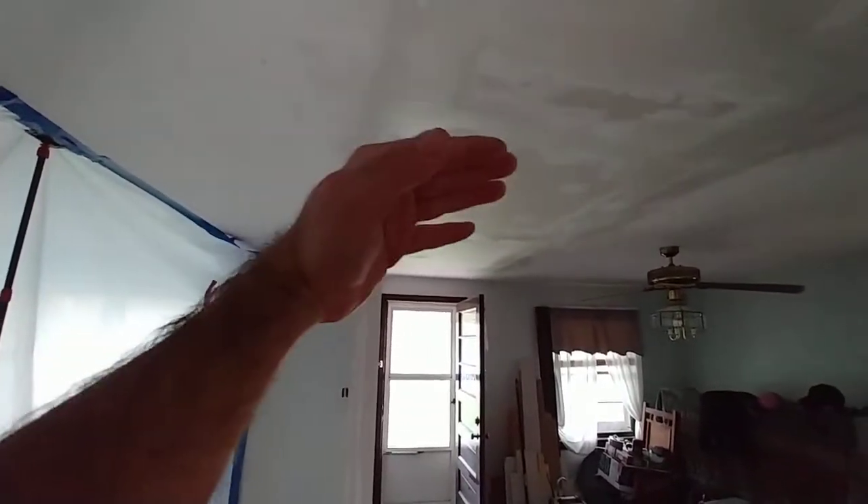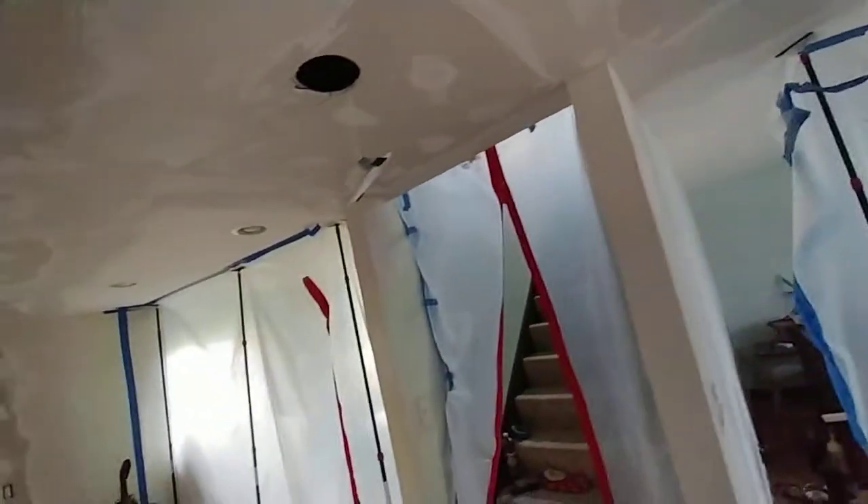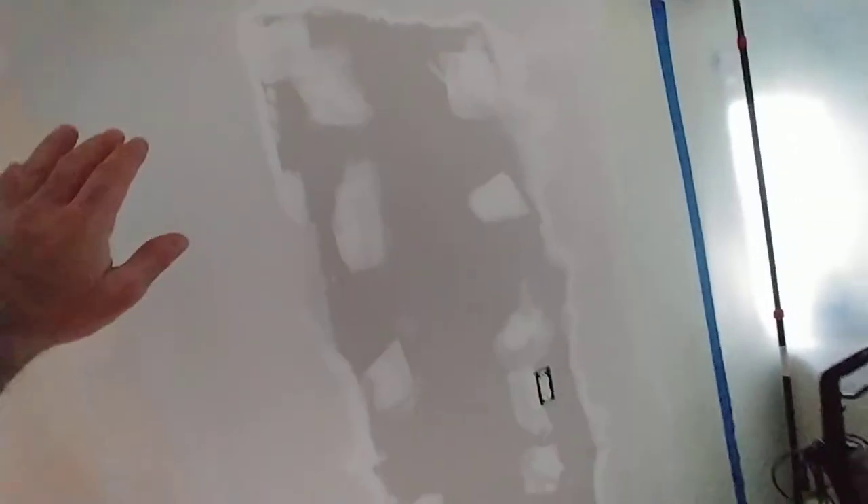It just rolls up onto the higher existing board finish. We had that wonky area here that got a lot of fill, and you can see it with the gloss. We don't want to see tape in here anymore either. When we tape originally we can see the tape lines, and when we're done with our first coat of mud I don't want to see any tape through it — because when we do a light sand we don't want to pull up the surface of the tape. Those will be the first places I touch up when I come back. We don't want that fuzzy tape showing up.